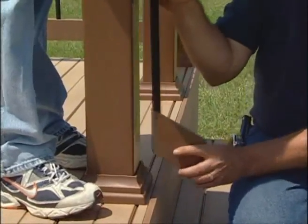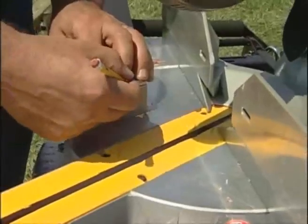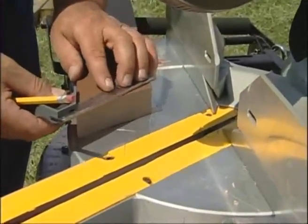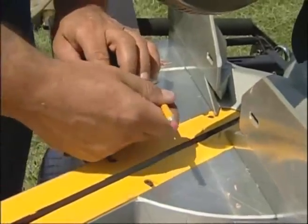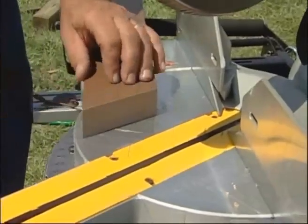At the top of the stairs, you will need to trim the builder board for a relief cut for the brackets at the top of the stairs. Measure up about 3/4 of an inch along the angled cut and cut back from there at a 45-degree angle. You won't need to make this modification at the lower ends of the rails, just the upper ends.